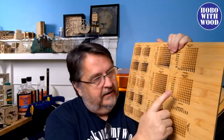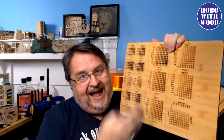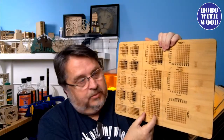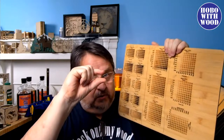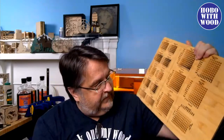And that is my understanding of why this came out much, much darker and deeper than these did, because scanning it on the Y, it's a wider beam at 150 lines per inch. Now I'm scanning it on the X, same lines per inch, but it's a narrower, 0.22 beam. It didn't get any wider. It just got out of focus.